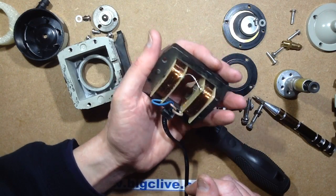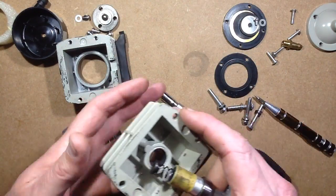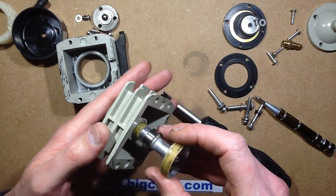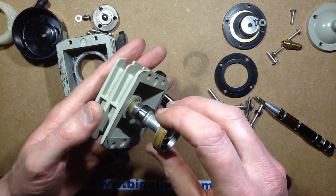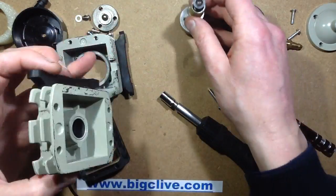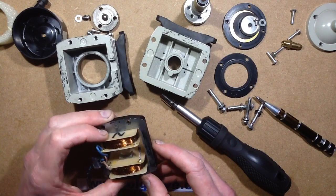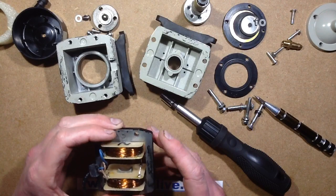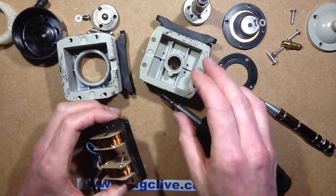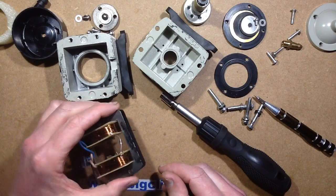It's quite interesting and very simple — not a huge amount to go wrong. The ceramic component is really just being used as a smooth, hard-wearing bearing — possibly Teflon or something similar. A concern is that without earthing, if the windings burnt out, the plastic could melt and create a hazard. If used in a serious application, it would be worth adding an earth stud to the housing. But overall, quite an interesting and simple little pump.